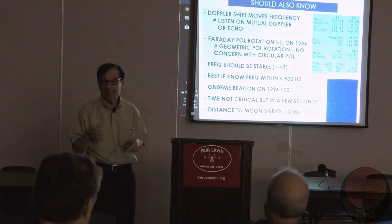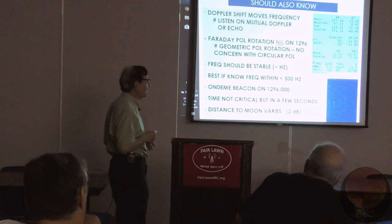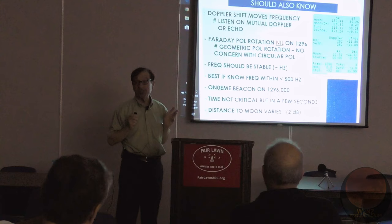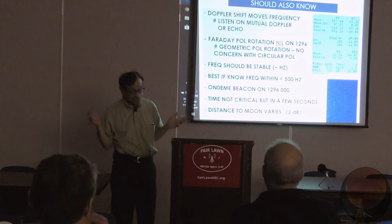But you really don't have to worry about it anyhow, because most people are running circular, as I tried to explain, and that eliminates the problem. But if you're not aligned, it is a difficulty. I could go on and talk about this, because this is one of the things you deal with in getting everyone to coordinate. For some reason, people start operating on 3 centimeters linearly polarized. Every other microwave band, they operate circular. 1296, 13 centimeters, 6 centimeters, 9 centimeters. They all operate circular pole, okay? What do they operate on 3 centimeters? Linear pole, right? So you got a problem.